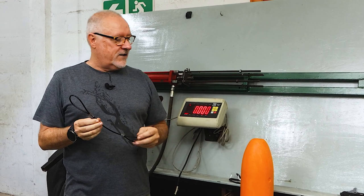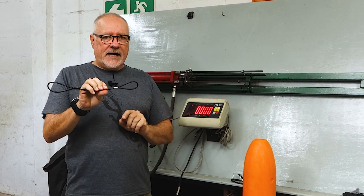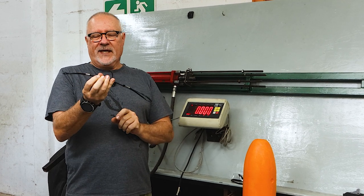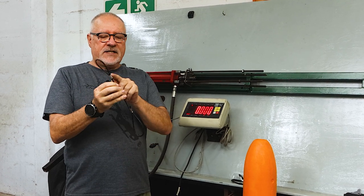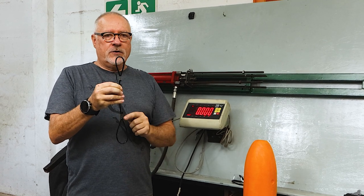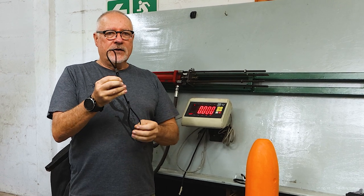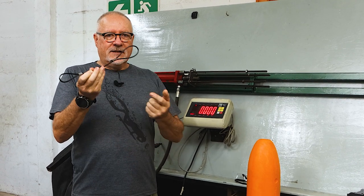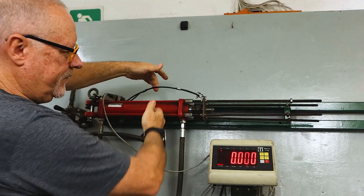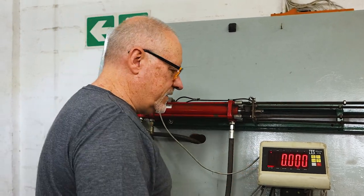We don't need 20,000 — we don't sell that many of these floats. So I've designed my own crimp. This is a stainless steel tube formed into a crimp — it's the smallest one we can try. I want to test it and see which is stronger. If it's strong enough we're good to go; if not, I'll keep increasing the length to match the original. Let's see how strong it is. Setup is the same as always — load cell scale in kilograms.